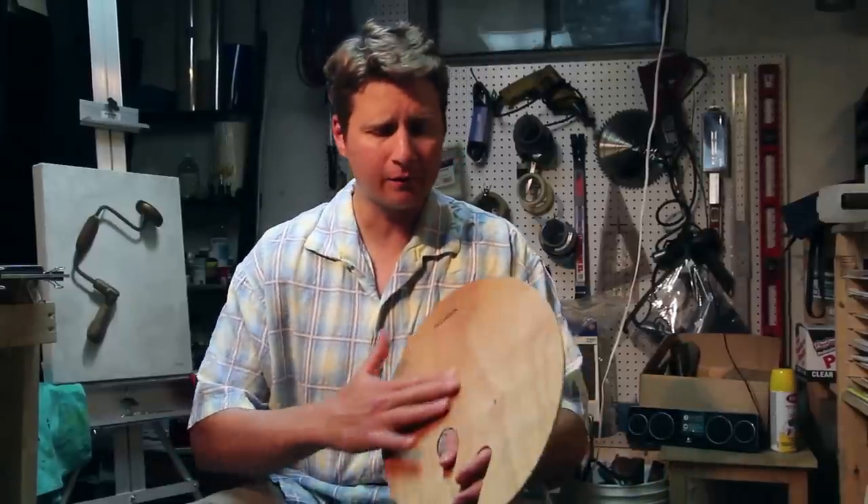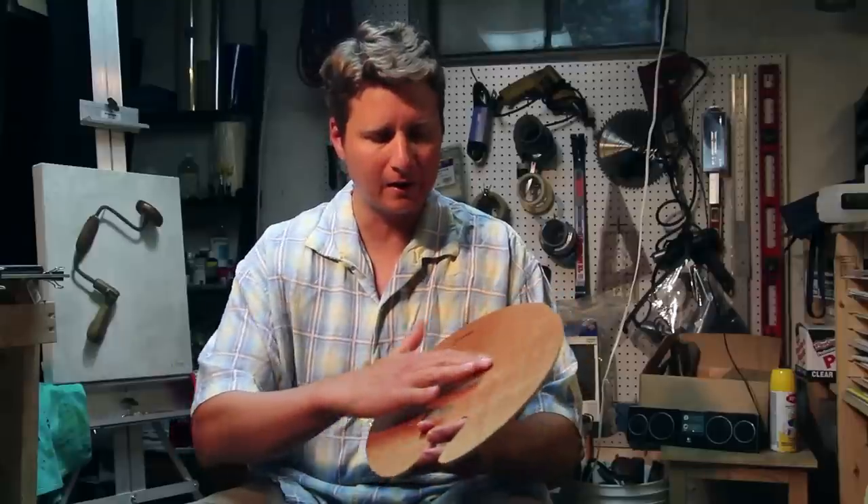Here I am about a week later. I ended up adding three coats to this pallet using the linseed oil. I let each coat dry overnight, and then I gave it a very light sanding with the grain with 400 grit sandpaper. Then I let that last layer of linseed oil dry for several days. This pallet looks and feels great — I can't feel any of the wood grain. I can't wait to put some paint on this and use it.